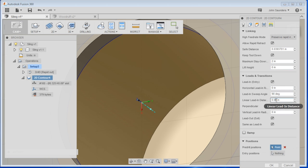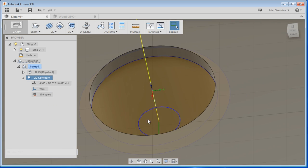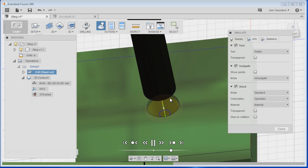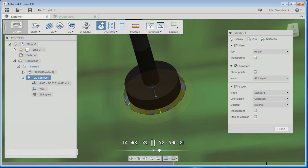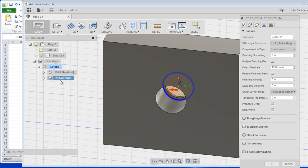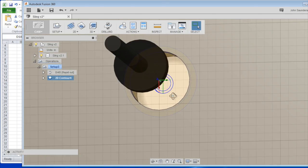Just to show — if you move it to 0.085 or whatever, you'll see it goes beyond and back up here. So let's do a quick simulation. It drills through, and you can see — very importantly — we're going to come back and retract without crashing the tool. That's what's fun about this. And you can see we've got our little woodruff slot cut. One quick tweak: in the 2D contour, multiple finish passes — two passes at 0.015 — and what that will do is just ease it in and cut in two passes instead of one full width-of-cut pass.